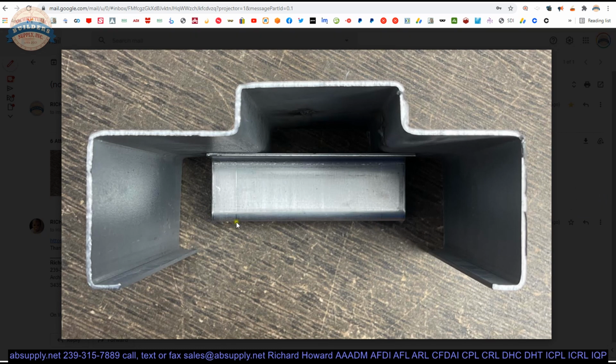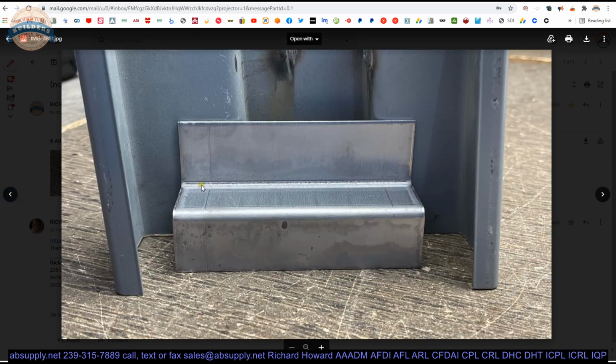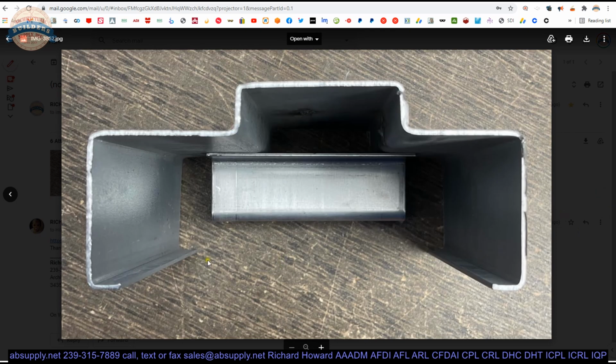Perfect geometry. Now, this is meant for a 5 3/4 depth frame. The length of the FR290 is 4 inch, well, it's slightly sub 4 inch. It's going to leave just enough room to get that 1/2 inch drywall penetration. And what I mean by that is the dimension from the frame to where the face of that flange is.